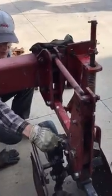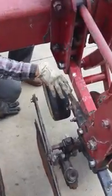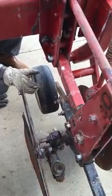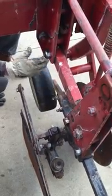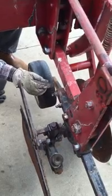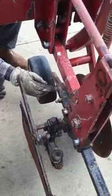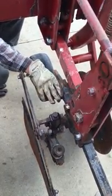A lot of times you can cut a piece off somewhere and weld it on the front of this so that you can move this ahead 1 hole or 2 holes. If you just weld a piece there with 2 holes like this, then you miss an opportunity to have more adjustment. So I would add 2 more holes, but make this hole here line up with the very next hole, so you can still use that one.